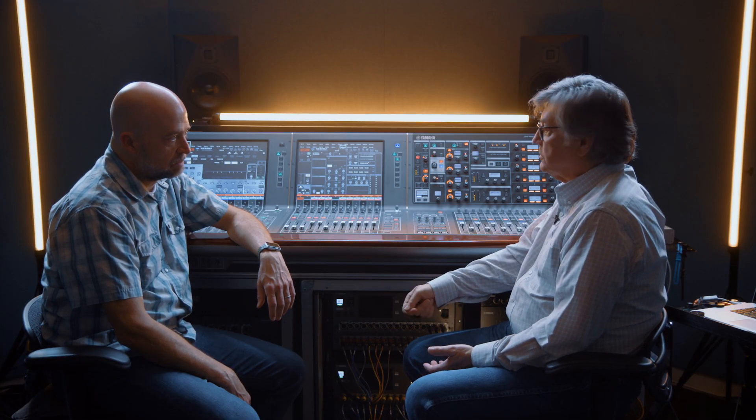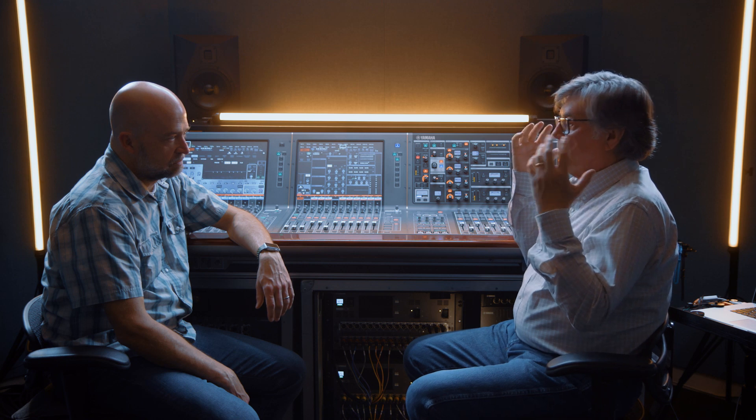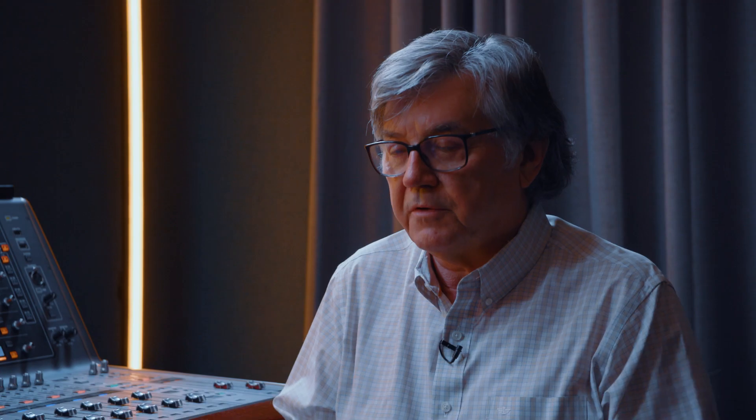The transformer has a tendency to sound like a slight bit of compression, especially on percussive things like kick and snare — you'll think it's being compressed, but that's the effect of the transformer. On a kick drum, if you take the blue silk and turn it up, you get some punch out of it. If you do that after you EQ, it becomes overwhelming. But if you do it before you EQ or set up your channel information, it will definitely change how you handle the channel strip.